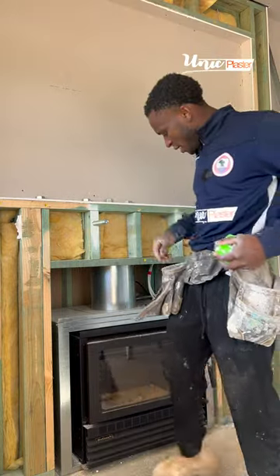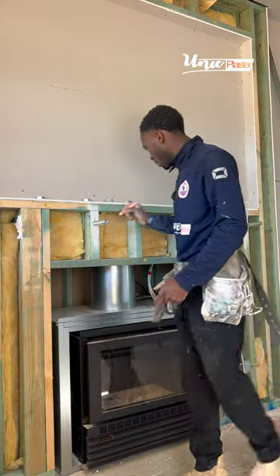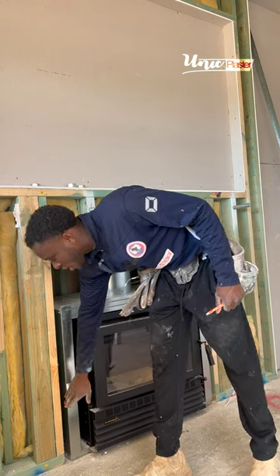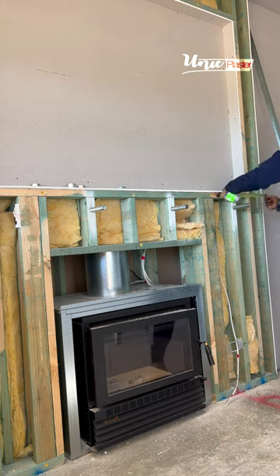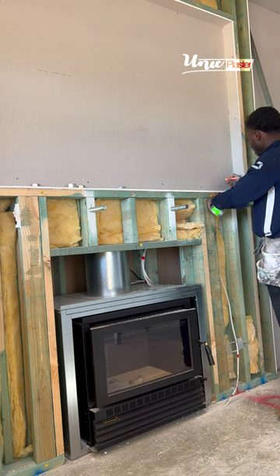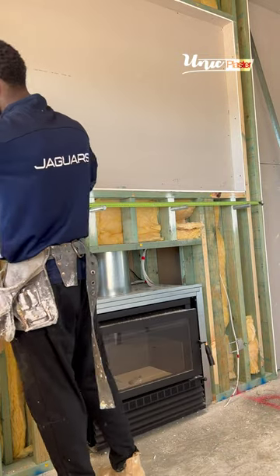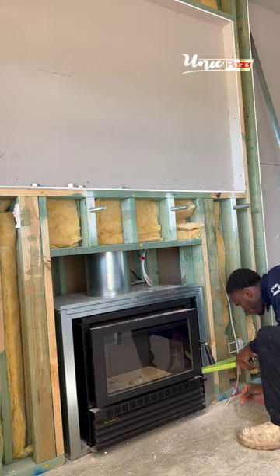We're gonna go ahead and start measuring. You just want to measure from timber to timber — get the center of these guys right here. I'm gonna measure around this black bit, not the silver bit. I'm going to come from the timber, not the plaster, because that's not where you want to be. Just measure to the center of this box — 272. The full length is 292, take off 5 mil so it actually fits — 710, I'm gonna go 705.